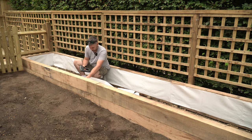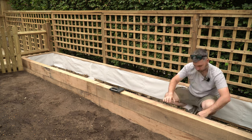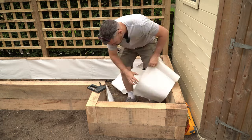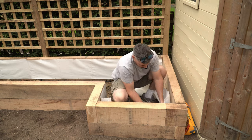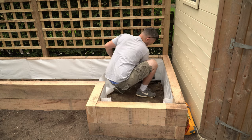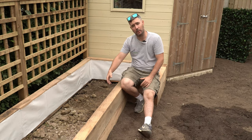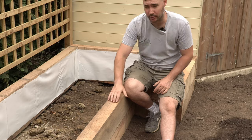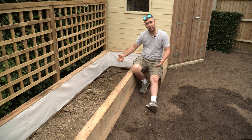When you get to the supporting posts on the inside you'll have to cut the sheeting in around the posts, which is a little bit tricky. Then you can cut the tops and fold them over to totally encompass the supporting posts to make sure they're not going to be in contact with any soil - that gives you double protection. So now we've bitumened the bottom of the sleepers, we've bitumened the supporting posts on the inside, we've also wrapped the inside of the sleepers, and we're using oak sleepers. This is going to last a very, very long time before it starts to rot, and now you're ready to just fill it up with your soil.